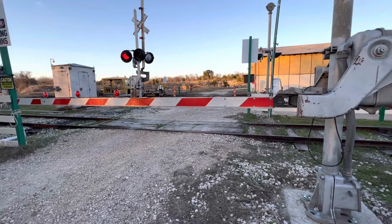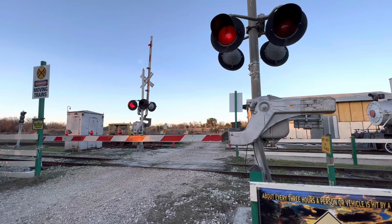It's considered illegal. If I lift up the gate and the hold clear engages, then chances are the motor is burned out. If the gate drops right back down without the hold clear engaging, then it is likely a problem in the bungalow or underground wiring, something not connecting right. But I'm going to verify that real quick.